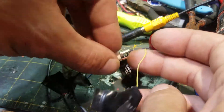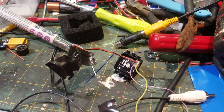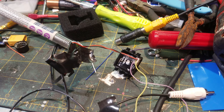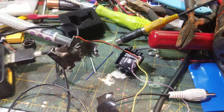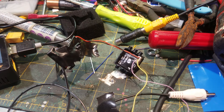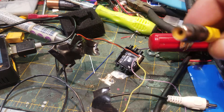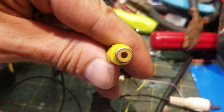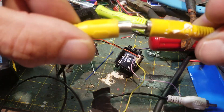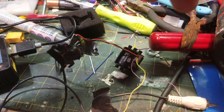So now we have the yellow cord coming out of the camera connected to this RCA cable we sacrificed. The positive and negative are powered by the USB, which I'm going to plug in here — that's just a normal USB charger putting out 5 volts. You can take this and plug it in. This is my monitor cord — you'll actually see this on the back of your TV; it'll either be yellow or green, a connector like this. So you'll need the male connector. If you don't have a male connector, I'll show you how to do it the skeezy way. We're going to plug it in and see if it works.